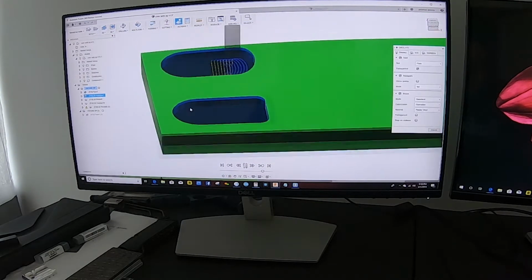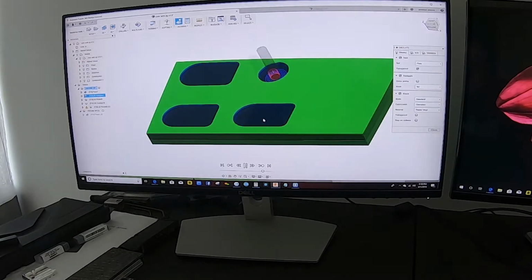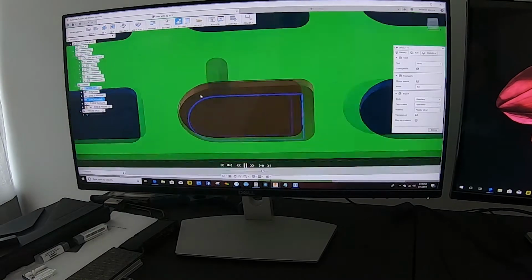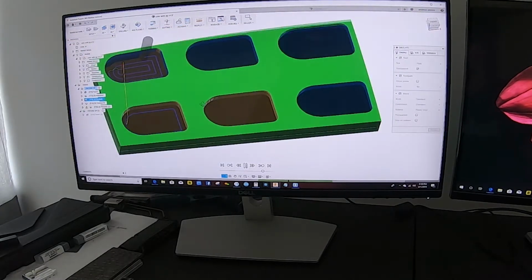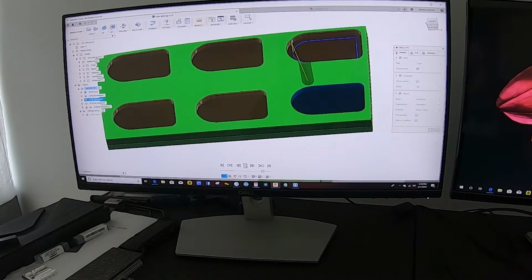This is aluminum, plus, you know, quarter inch. That's a pretty big tool. Boom, boom, boom. Decking it off. Oh, clear it out. So then after that, we're going to come in and do a pocket. Yes, yes, yes. Mind you, we left 7 thou on the wall to clean up, do a finish pass. So it's cleaning up those pockets, cleaning up those pockets. And now here comes the spring pass. Boom.